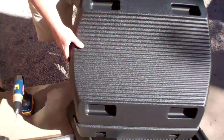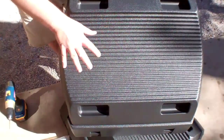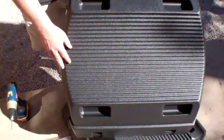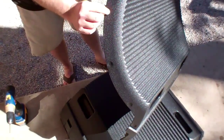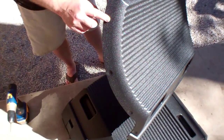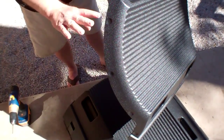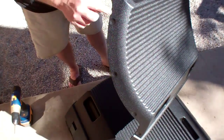Okay, next you have to pre-drill the sides for assembly. You've got three of these sides. Very important here, you're only supposed to drill through these little indentions here. You're supposed to drill with an 1/8 inch drill bit. You're only supposed to drill two of these panels. The third one you do not touch. So only drill the holes in two of these panels.